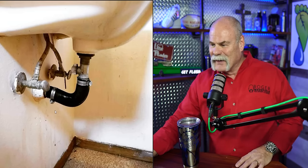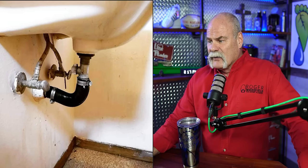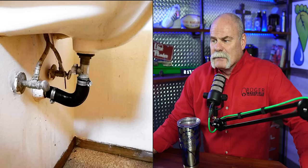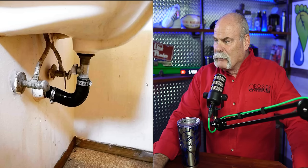This one I thought was funny. Everything looks nasty under here — valves, escutcheons, everything is corroded and funky. It definitely needs a lot of work. I'm going to call it a heater hose — this literally looks like a heater hose that's been electrical-taped over to make it look really good, or it may just be leaking and wet. It looks like they got the hose clamp nice and tight here on the bottom of the pop-up assembly. The way it comes down, it's like they almost used it to make a P-trap, which at least would keep the sewer gas smell out — but it doesn't look like they came down quite low enough, so you're probably still getting sewer gas through there.